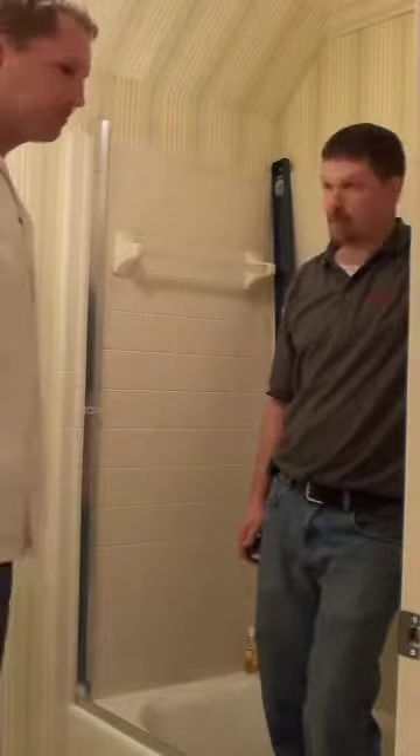Some people are real particular about what their center reveal is, but as long as the finished product looks good, you've got good penetration, and you don't have a leak, that's what matters. It's real important that the customer puts a level on the wall to see if the wall is leaning out or in — any help they can give to the inside folks at Cardinal is better, because then they can make the decision whether the wheels will adjust out enough or if they need to do a rip filler for the whole wall. These doors are a 3/8ths cast door and they have the Cardinal Armor on them. I'm going to put rubber gloves on to give myself a little bit of extra grip because that stuff is slick, and they're cast so a suction cup would be useless.